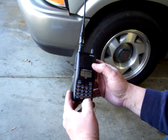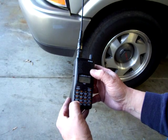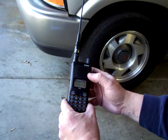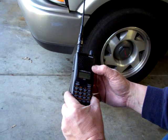Now we want the frequency. The frequency is 146640. We got that. Now we need to set the shift. As you can see up here on the top, these are your shifts. As it is, it's already minus, which is what we want.